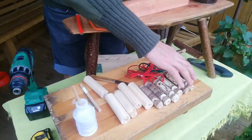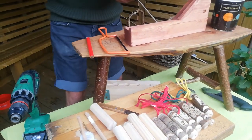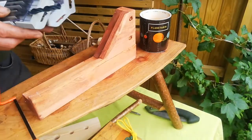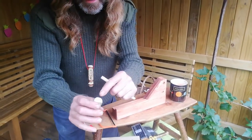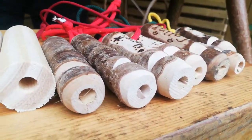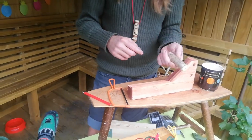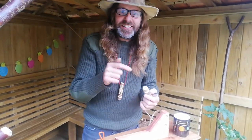These different sized bits are going to be used to ream out the hole that the reed sits in. The reed is that little insert — it's the bit that does the magic and makes it whistle. We've got some glue — health and safety glue — because when I put the reed in and you take it home, your home has a different moisture content than my garden and workshop. The timber dries a bit further, the reed goes a bit loose, and you don't want it going down your throat. So the health and safety glue holds the reed in place.